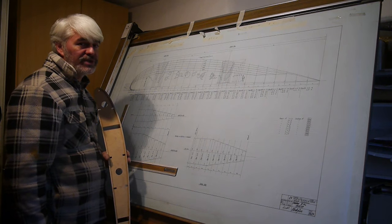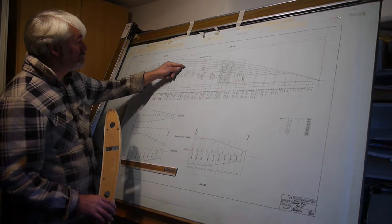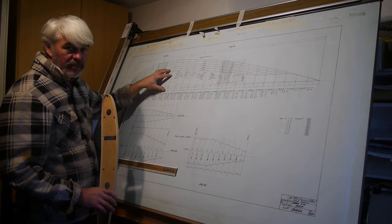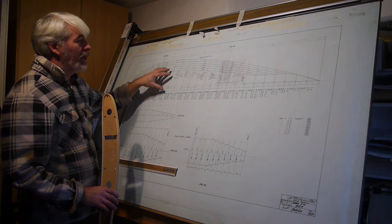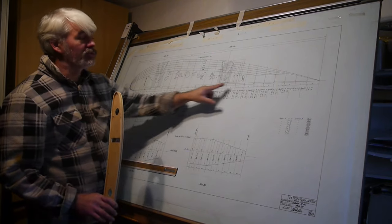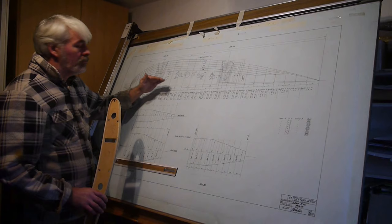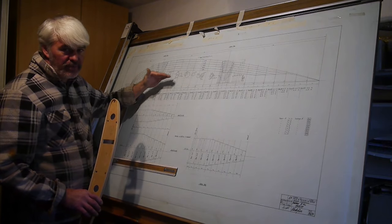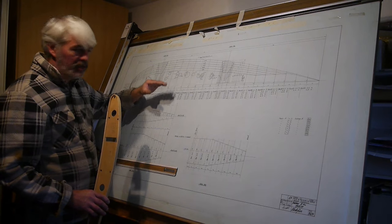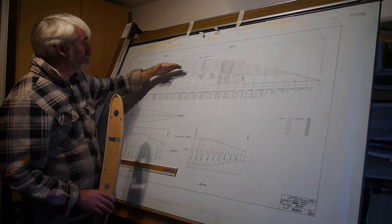So much about the design of the airfoil used with the Fokker V40. This is the conclusion I come up with. I need a trajectory to construct the intermediate ribs — this is not a construction drawing. This plan is only a constructive way of defining a shape that lies between two given shapes. As the underside of the profile is identical for all ribs, I don't need to draw this as often as I have ribs in the wing.